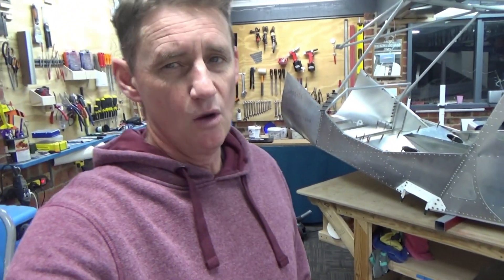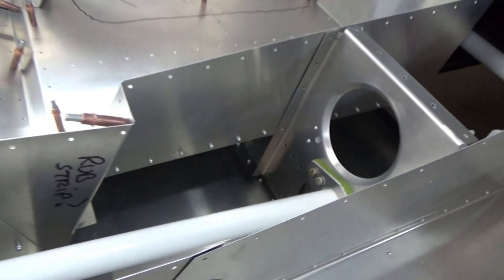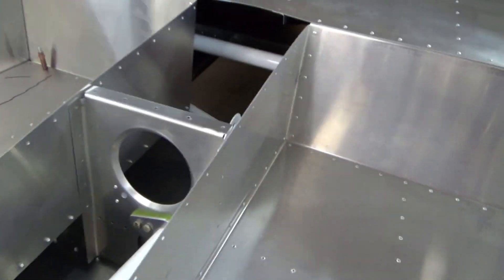I think the firewall will come back out and I'll paint the interior of the fuselage, especially the front half, before the rudder pedals go in. I've just put the main control rod in there — the mixer arm that rotates for aileron control. It's a bit tight because I've painted it, so I'll just clean that up where it goes through the bearing. A couple of hours tonight, not too productive.